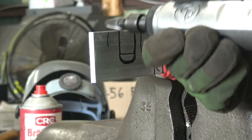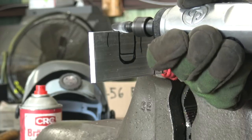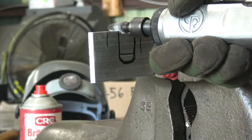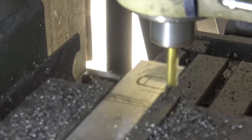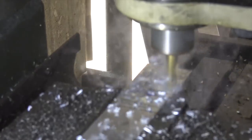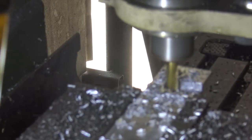I'm working on rewiring the old tractor today. I'm trying to install a taillight on the end of it — hopefully a pretty classy looking one. It's a reproduction for like a 1932 Ford. I'm in the process of making a bracket for that. I started off with the angle grinder, pretty much immediately decided that life is too short and threw it on the mill, and I was able to mill out a slot for the exit point for the wiring on the back of this light to clear.